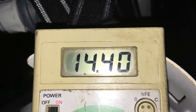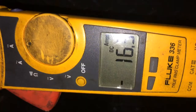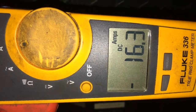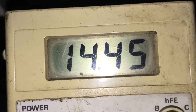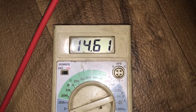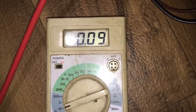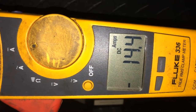Batteries showing 14.4 at two hours 15 minutes. Two hours 30 minutes: 16.3 amps. 14.45 at the batteries, 14.62 at the charging block. Two hours 45 minutes: 14.4 amps. We're at 14.46 at the batteries.